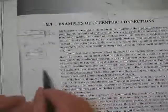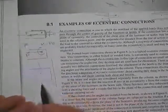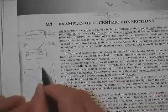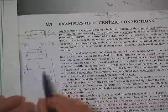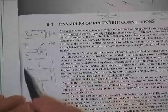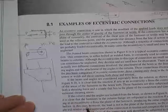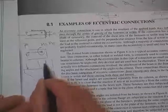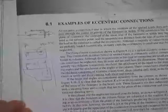More generally, that's done when you have a plate that looks like this, welded to a column, and you just weld it, and the load's out here. Then you'll take that load and pretend it's on the centroid of the weld, and that all 50 kips comes out in all 10 inches, 50 divided by 10, all the way around. Then you come back, and on this weld group, you put a moment, P times E, to handle that part of the load on the connection.